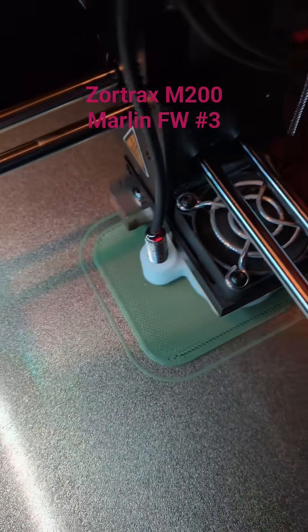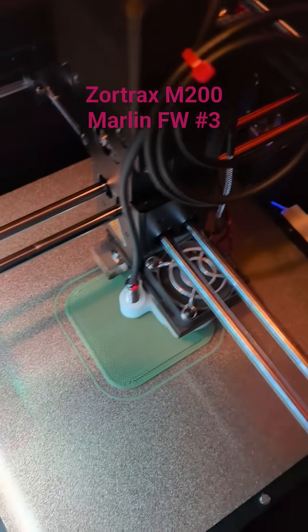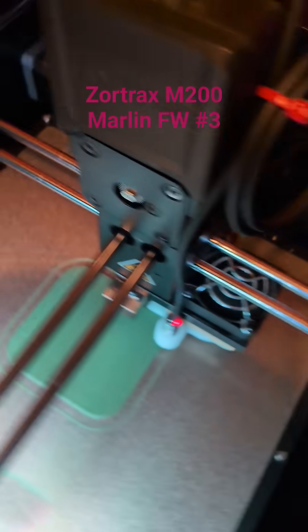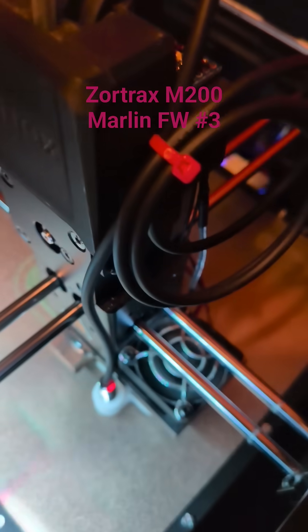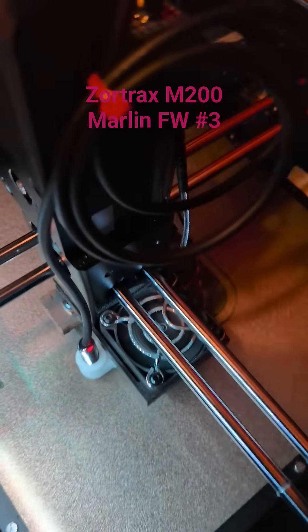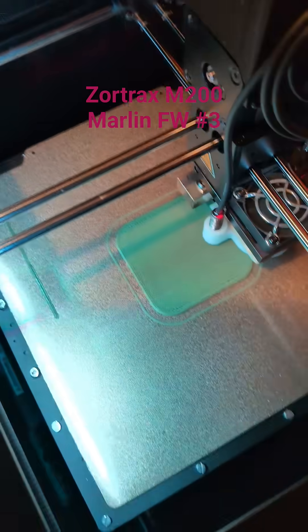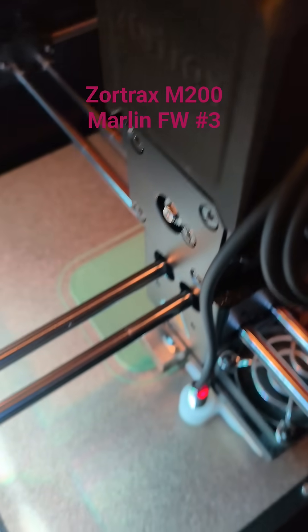In theory it seems to work, but in practice I'm having real problems with this filament. I'm probably doing something wrong, and tweaking profiles in Orca Slicer is really not that easy. I'm pretty sure this print will separate in a millimeter or two from the PEI sheet and I'll have another spaghetti failure. I think it's the profiles, or maybe the temperature here in my attic lab which is just 19 degrees. I already increased the bed temperature to 95 degrees hoping the top reaches 80, so let's see if I'm lucky this time.